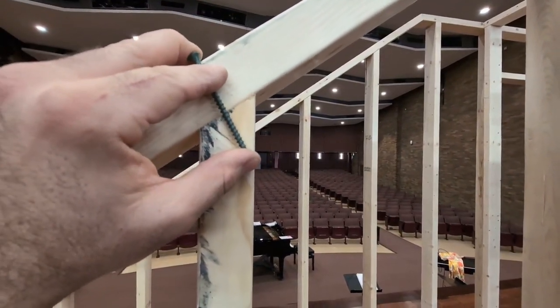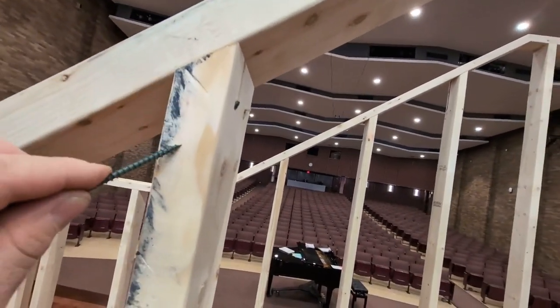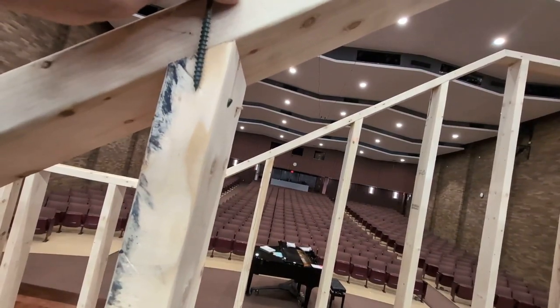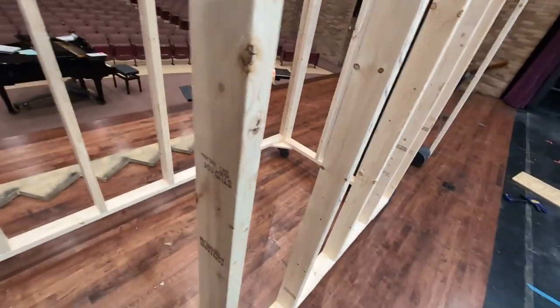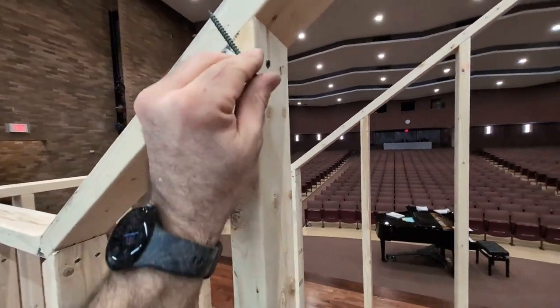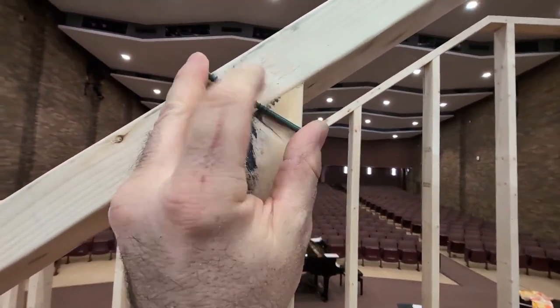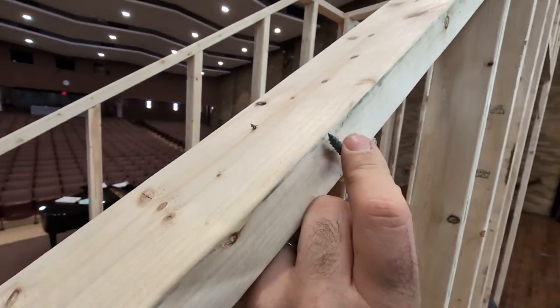As well as that problem, you're going into the end grain again, and it's not that strong. Certainly not with fewer threads. This would be something that you could probably kick out if I had screwed those in like this. You could beat them with a hammer to the right, and it would start trying to rip apart. Alternatively, I put the screws in like this. You see that? Now we're through the side of both of the grains, and in some cases, they tip out a little bit like that.